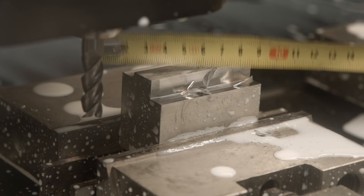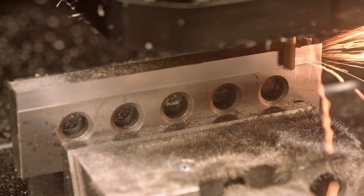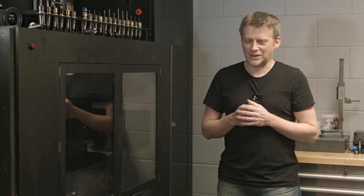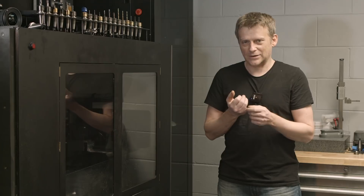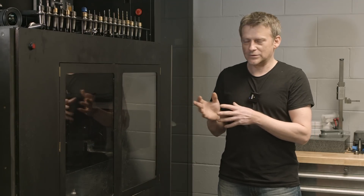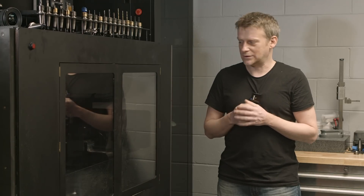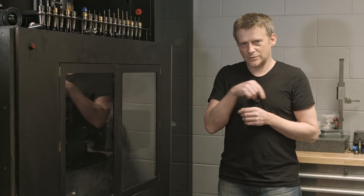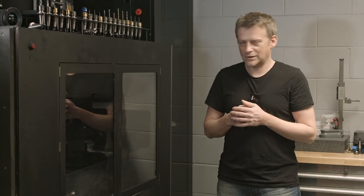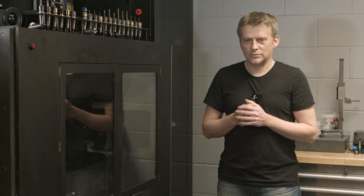Size comparison — it looks like you don't need that much power to cut steel either. I did that cut with exactly the same settings. It doesn't really matter if you're cutting steel, aluminium, or wood. As you've seen in that example, the spindle was giving up before the steppers — or servos in this case. The servo was going and the spindle starts slowing down through the cut. I could do thicker cuts, but I won't be doing that because I really care for my bearings.